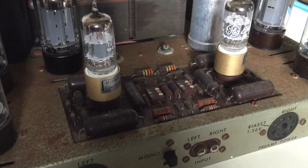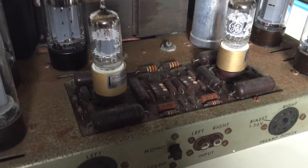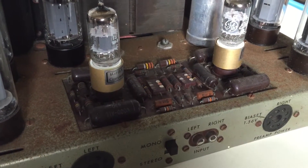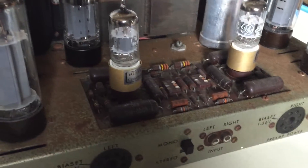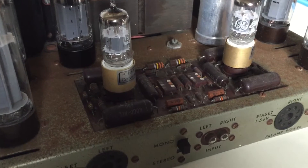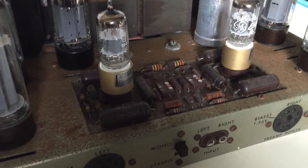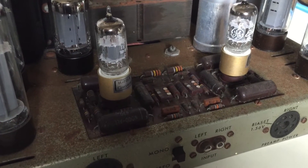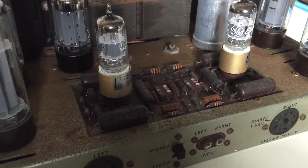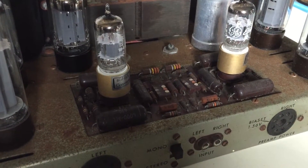When dealing with radio equipment or ham radio equipment, when you get above about 2 megahertz, this becomes increasingly important. But it has no relevance whatsoever with regard to this amplifier. So if you're going to choose a resistor, be it carbon or another type, so long as it operates within the parameters it's supposed to, within the heat ranges it's supposed to, and it is the correct wattage, it will function absolutely fine.